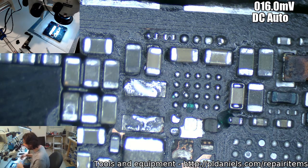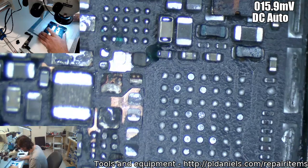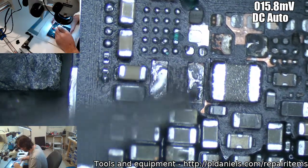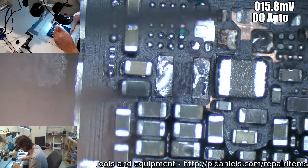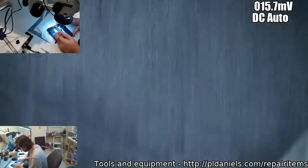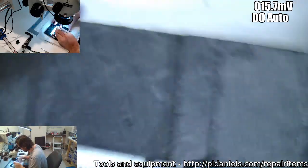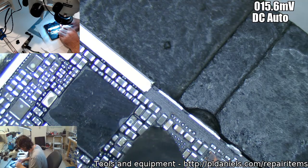Chestnut should still... Yeah, that is true. It should still boot even without chestnut, or at least certainly go through a bit of a boot pattern. And I know that on this one because prior to me fixing it all up, we did have a problem. The ultimate fault in the end was this coil here. It was, as you can tell by the pads, a complete ratchet. It was destroyed. One of those vias, are there any vias coming up for that? But even still, even if you ignore that whole section, it was booting with proper current behavior until it just faded to black. Like I said, I don't know, after that I tried taking this off, took everything off that I'd done work on prior, and it still just kept staying with that same behaviour.